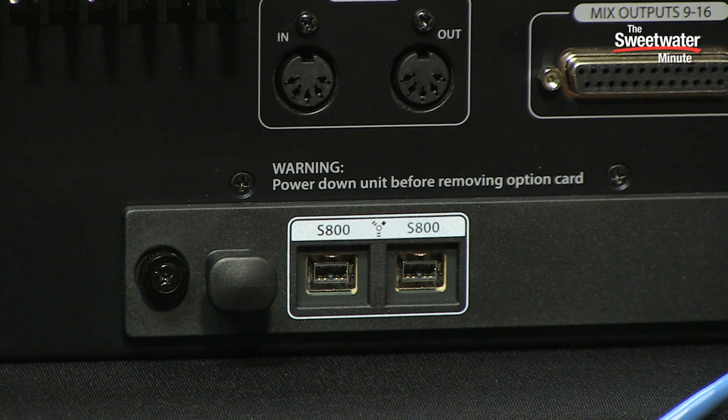You may notice that this lower right-hand section of the back panel is actually an expansion card. There's a slot in there that can accept different cards that will give you access to different digital formats for input and output. Now, these are the same format cards as will fit into the desktop StudioLive AI consoles from PreSonus. To take charge of all the parameters inside the RM32, we use the Universal Control AI app.